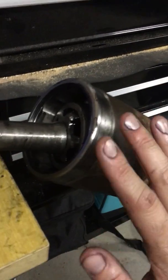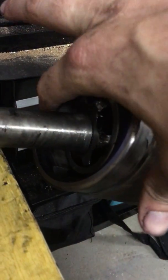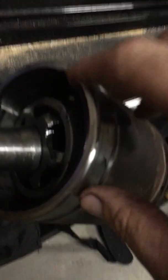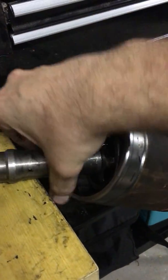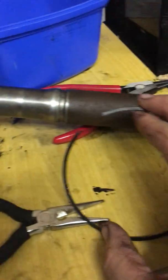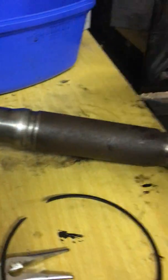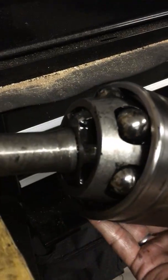It's actually quite easy — you don't bang it with a hammer or anything like that. There is a little circlip that races around the outside of the housing. Now for demonstration purposes, I've already kind of half taken it off. So you can see here — take that off. That's what it looks like. You just need to get in there with some inner nose pliers or something. I used the circlip removers. And then it just simply slides right off.